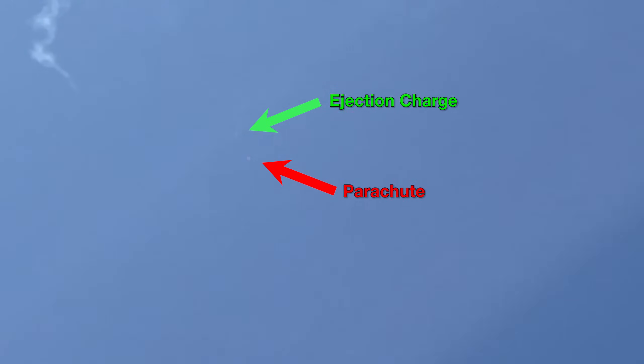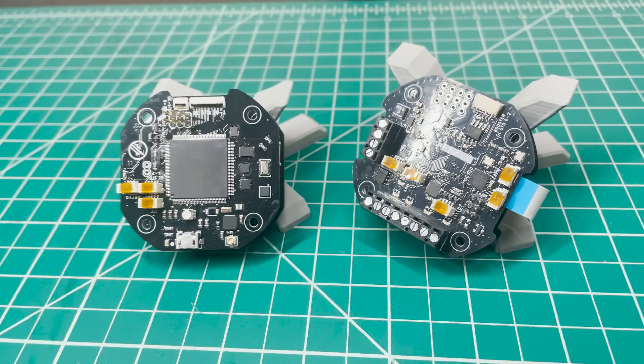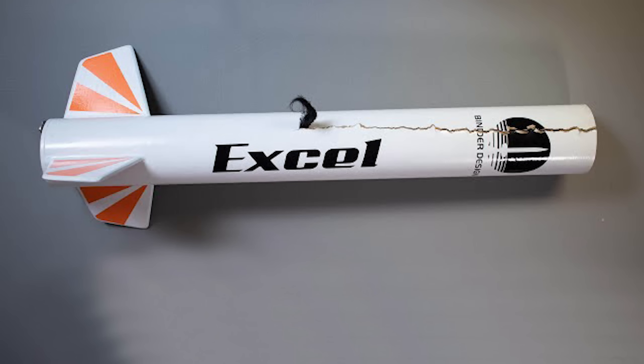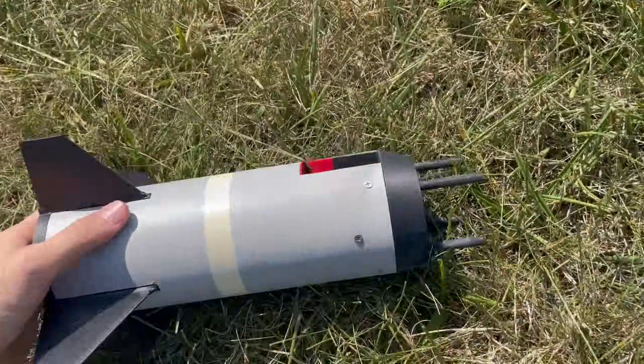Next, you can see the guidance mode change. The camera loses focus here, but the vehicle drops its angle of attack and starts a slow turn to the right, generally in the direction of the waypoint — though I didn't really expect this heading change. I would have expected the vehicle to pitch immediately downrange and hold a constant heading. That may be an effect of a slightly unstable roll during waypoint guidance mode, or it could be something else. As the vehicle reaches apogee, a bright orange parachute can be spotted from the ground, but people lose sight of it quickly. I'm not sure if the flight computer's apogee detection, the apogee backup timer, or the motor's ejection charge set off the parachute, but it looks like it was right on time. The shock cord tore — the ejection charge was just a little too punchy and snapped the shock cord at a weak point. This Kevlar was flown on a number of other flights before this, so a section of it may have just weakened over time.